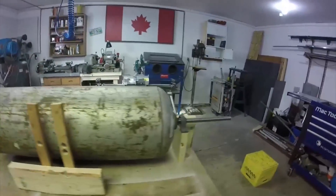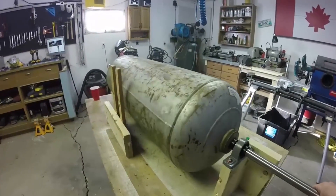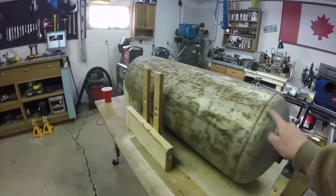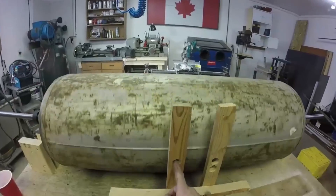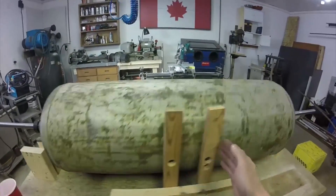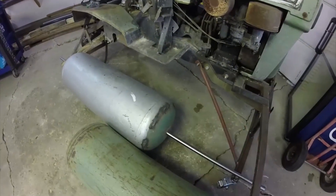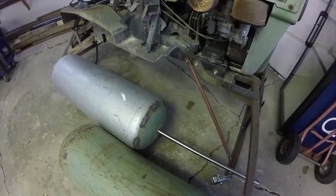I've mounted one of the tanks in this fixture — it's all made of wood, but it's just for one shot so I didn't want to make anything too fancy. That's going to allow me to stick my plasma cutter in here and slice off two 16-inch ends, and those are going to get slid onto the shafts and welded on to make a longer pod.